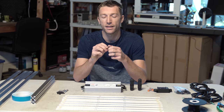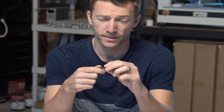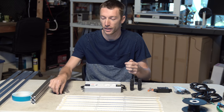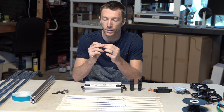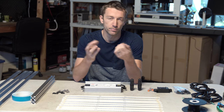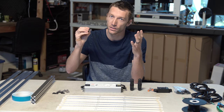We're just gonna be using a few T-nuts. We need 3/4 inch, and any size T-nut you want. These are the economy ones. I think these are like 13 cents or something, pretty cheap. I have it all in the spreadsheet at the beginning and the end of the video. So we're gonna be needing 8 of the T-nuts and the 3/4 inch quarter 20 screw to complement it. Obviously we drilled 8 holes in our heat sinks and we need 8 screws to attach them.